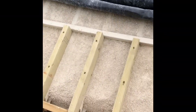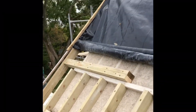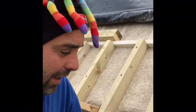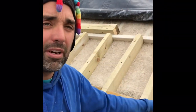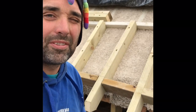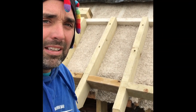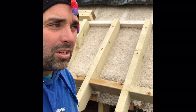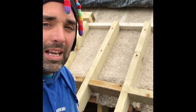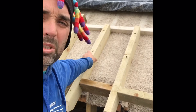These days we do a lot of insulation — 300mm is sort of usual. If you've got a 300mm rafter fully filled with insulation, you're bringing out a 300mm rafter, or even 200mm, then you're cutting it at an angle and putting a fascia board on — that gives you a disgustingly big fascia board. The way to get round that is to use what are called sprockets.